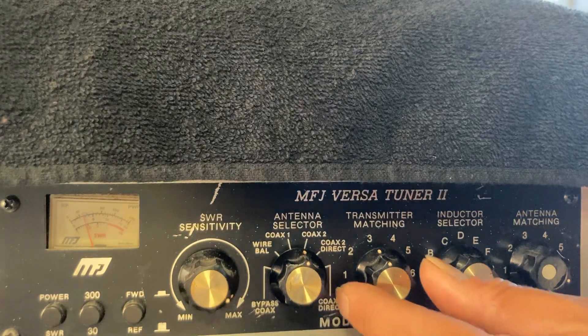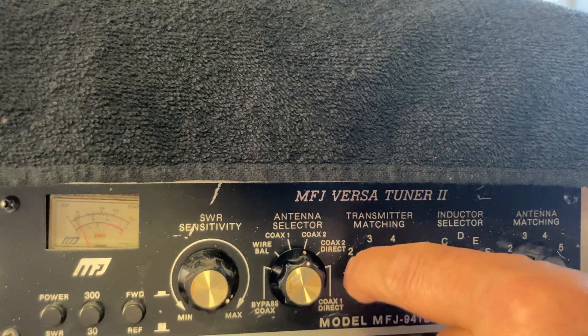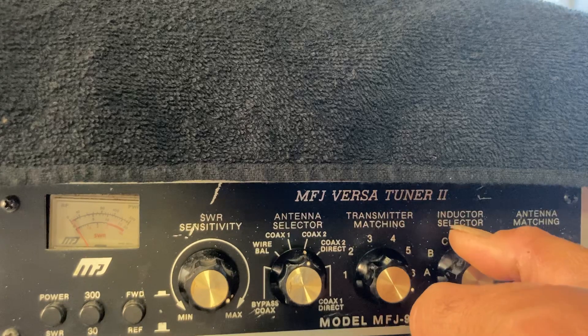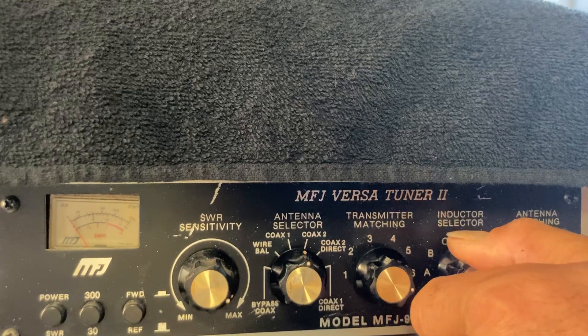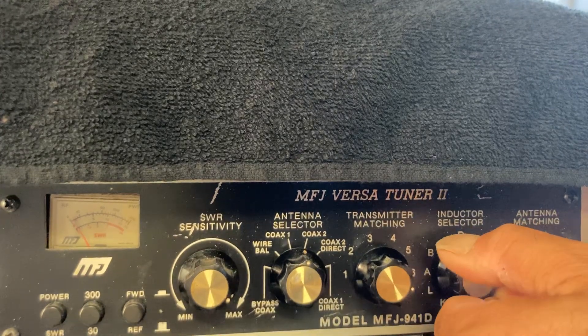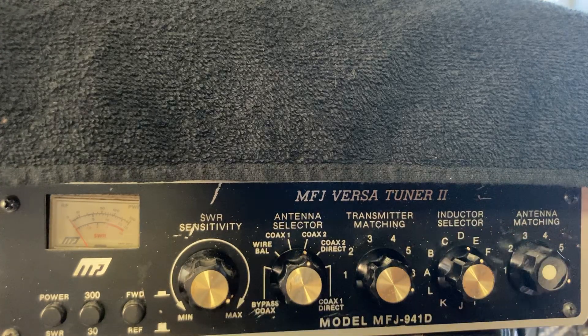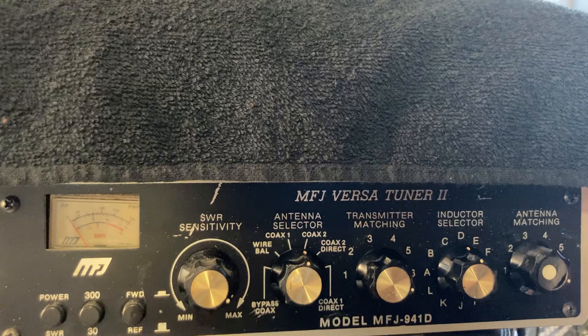But this is the whole point — you could adjust it down to almost flat here with these controls. And you can see you can make it worse or better. See, it goes up a little bit and it goes back down. So it's pretty much flat right there, guys. And that's pretty much how you do it on the AM band. Make sure you're on AM when you do that because sideband will not throw in the carrier.